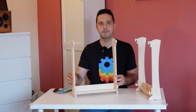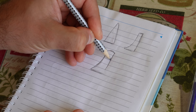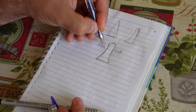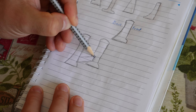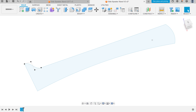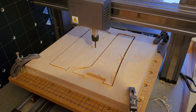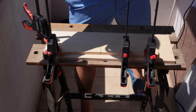And while Chrissy was busy making art, I had to build the stands for my speakers. My idea was to put the pieces of acrylic on a frame made of plywood. I wasn't sure what that was going to look like, so I sketched a few models until I came up with a design I liked. The front side, to which the plastic pieces are to be mounted, is flat, while the back is slightly curved to look more fancy. Another piece of plywood holds the two sides together while also providing weight at the base for stability. Initially I wanted to cut the plywood on my CNC, but I quickly realized that my machine wasn't big enough for the task. So instead, I designed the shape in Fusion 360, then split it in two halves and cut them on the CNC for absolute precision. Then I clamped them to a fresh piece of plywood and traced the outline with a pencil.